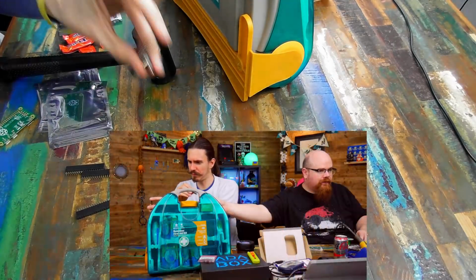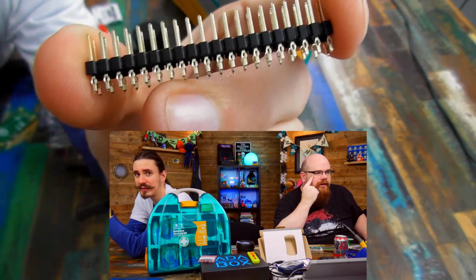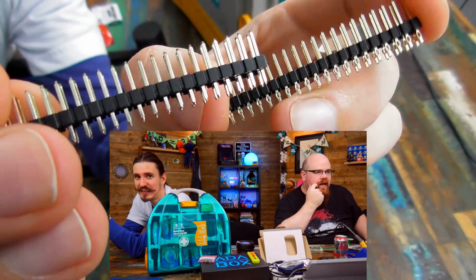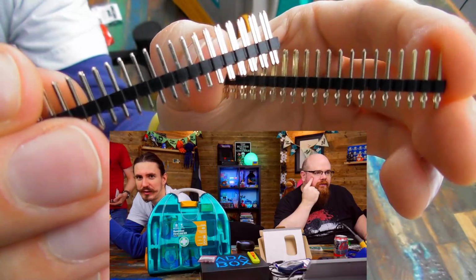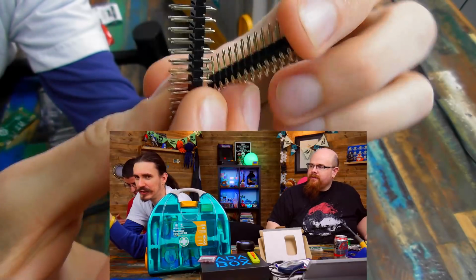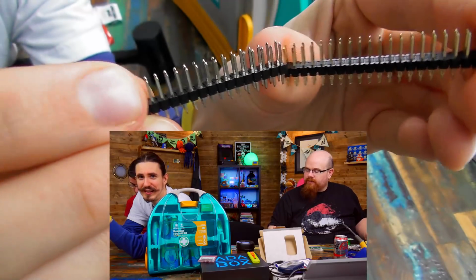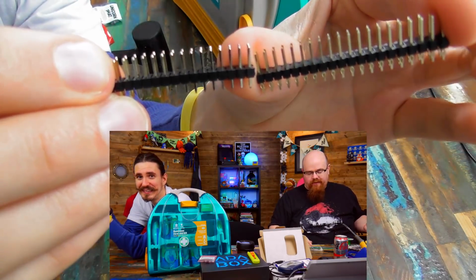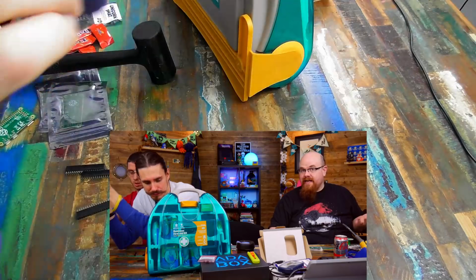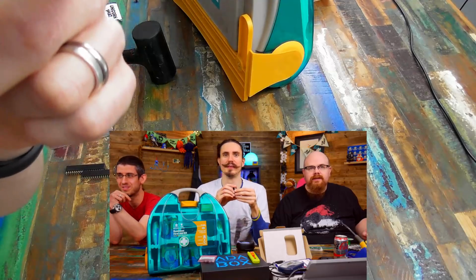You'll see the bottom of the pins looks a little bit like a needle, in that it has that strange eyelet in it. And they're quite thin as well. They're blade-like. They are not for threading thread on, as you might imagine, but rather for forcing into the holes of a PCB. So they basically make a mechanical joint from compression alone. It's an interference fit, and it stops you having to solder, say, 40 pins, which is fantastic. We also have the female version for headers and anything else that needs a header.